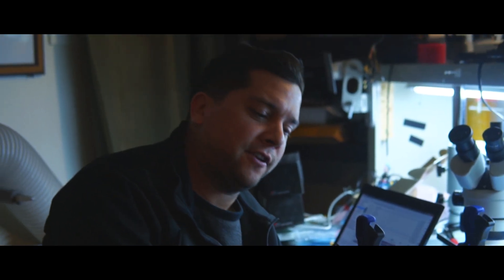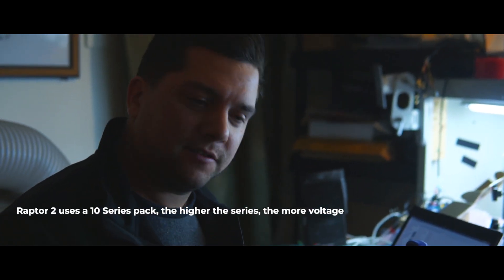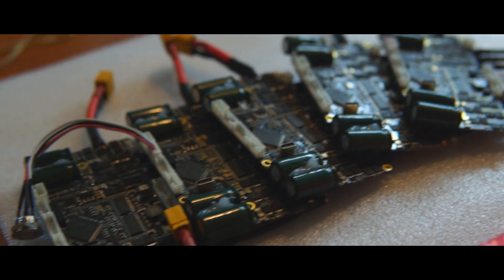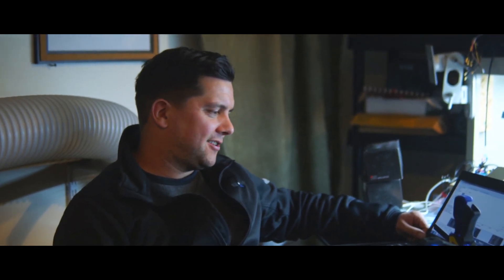Do you feel like going crazy with a 14s battery? May as well. Now we're testing a max RPM test with 14s, because 12s is not high enough and we happen to have a 14s battery here. We're not sure what's going to happen. I'm going to write this configuration and increase the max input voltage. Volts in: 57.5. That's scary. I'm going to start spinning this thing. I'll have my button on the escape — just the kill switch.